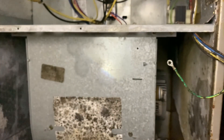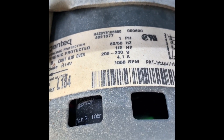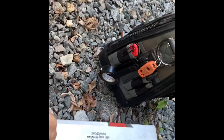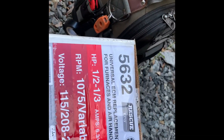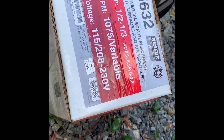I have the right ECM for this: 4.1 amp, 1050 RPM. This is what we opted for — this is the X13 replacement rescue motor. As you can see: half horsepower, 1075, 208/230.